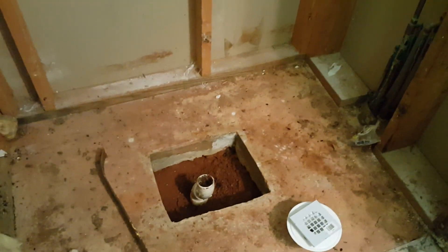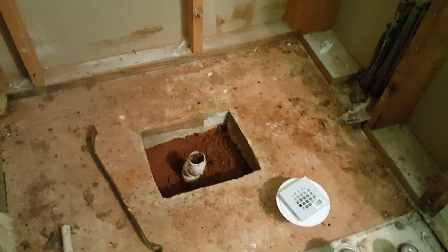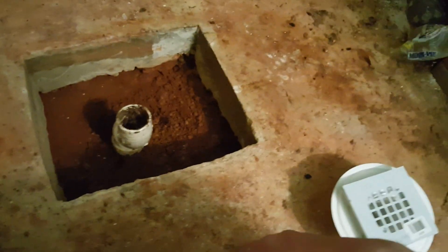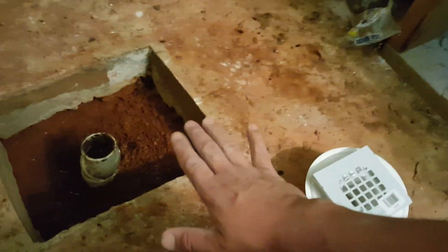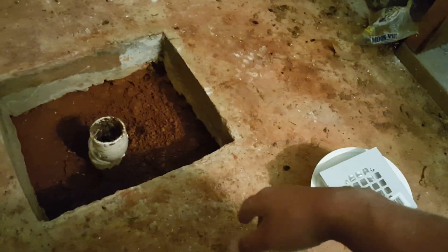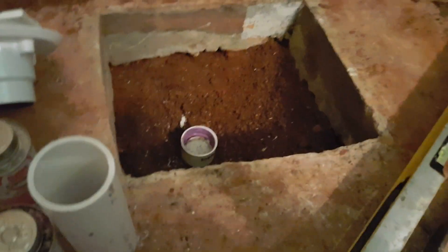For that we have several steps that we need to take. The first one is that you already have a drain over there that was connected to a previous fiberglass enclosure or shower base. Now we're going to go with a concrete or ceramic finish base. You always want to make sure that you tilt the water towards the drain — sometimes those things are not followed and you get pockets of water in corners under the concrete slab. These steps are crucial for adequate drainage and prolonging the life of your shower.